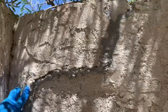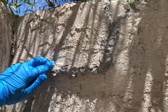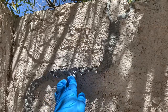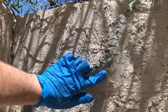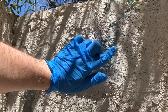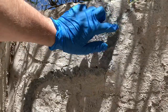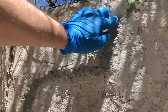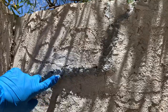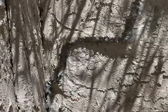I'm just gonna kind of mush my finger in here now because it's too smooth and I want to give it a little bit of blending, since this is a very rough stucco finish — which is another reason I have this glove on. I want to mash it around, put my finger in and out of it, and make the surface somewhat match the stucco. I may put a little more in there after this firms up. You can see it's still pretty loose. There's the first coat — I'll let that dry and put on another.